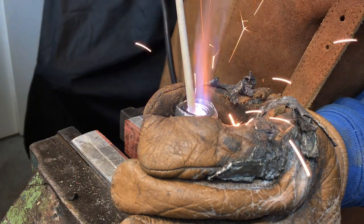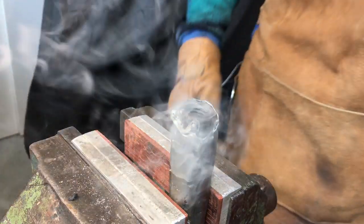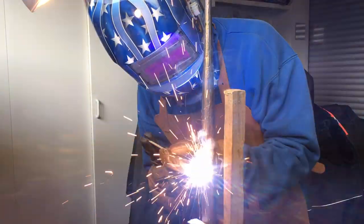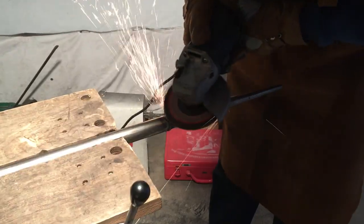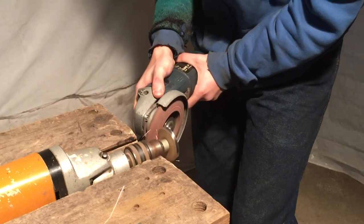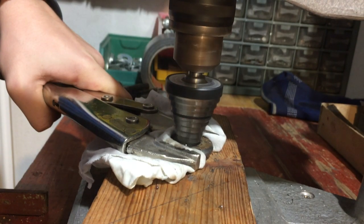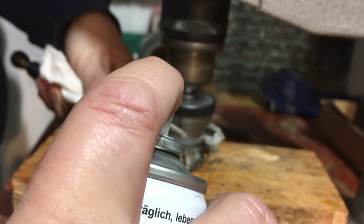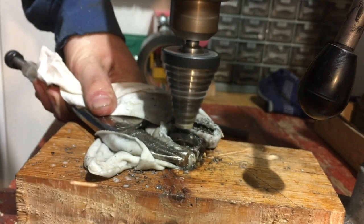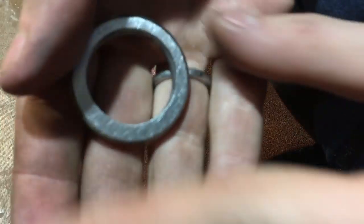This assembly part is going to feature a bit more narration. Here you can see me attaching a nut to the end of the bottom spike of the staff — this nut conveniently fit perfectly into the end of the rod, which allowed for a much easier connection of the two. After cleaning up the weld, the next step was to create that little ring at the end of the tip. My plan was to use a similar technique to the one I used on the marble egg — turning down a large washer to reduce its diameter. This worked really well. Next I had to drill out the hole in the middle, which proved to be a much bigger challenge. Eventually we managed it with a big step drill on my little drill press.